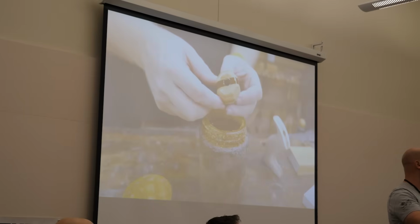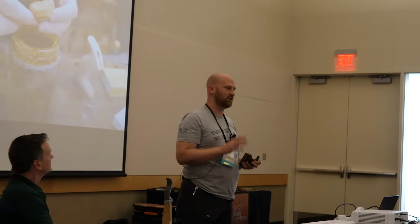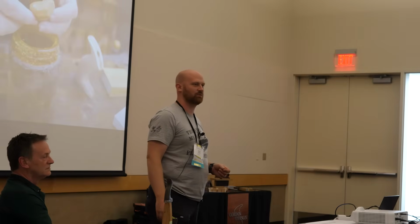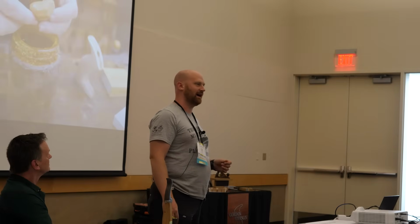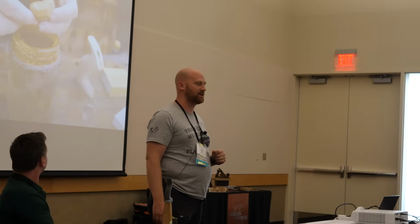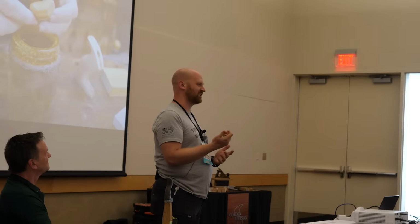I might come in with some sandpaper or a bow sander. I found that a very fine file gives a beautiful finish, as long as you're soft on the touch. I like that. It takes a little more time and a little more being delicate with it, but I like using files. Then for finish, for me, it's just boiled linseed oil and paste wax because I want to feel the wood. I don't like shellac on it.